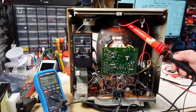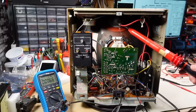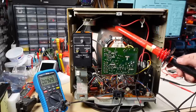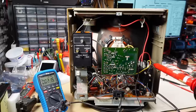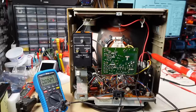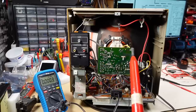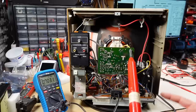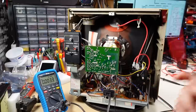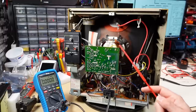One thing I can also do is poke around on the outside and see if we get any readings. Remember, if we had a one-volt reading that would be 1,000 volts. Right now we're not really getting anything here — I'm just trying to see if there's some kind of leakage, but no, there is nothing. I can hear little bits of static electricity, which of course is what's attracting all that black sooty dust. We're not even getting 300 volts — it's like 30 volts, stuff like that. Just for fun, let's take a look at the screen voltage on the yellow wire right here: we see 700 volts. If I turn the potentiometer on the voltage divider, that will change the screen voltage. Just know that there are high voltages on the back of this neckboard, like the 700 volts on this pin right here, and you could get quite a wallop if you accidentally touch that.